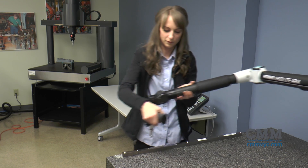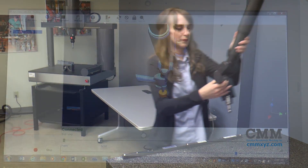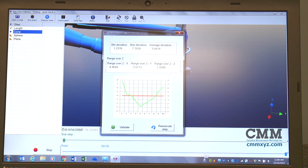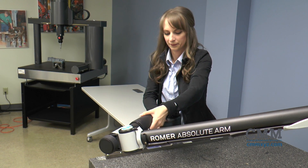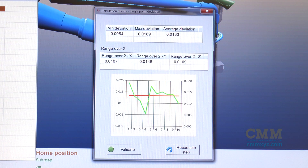The length standard can also be used as a point check artifact. Cone check — what is a cone check? A cone check is used to determine how repeatable a single point can be measured. The ball is placed in a stationary position and 10 points are taken with the arm articulated in numerous locations. Probe 10 points in a conical set as shown in the script's graphics.